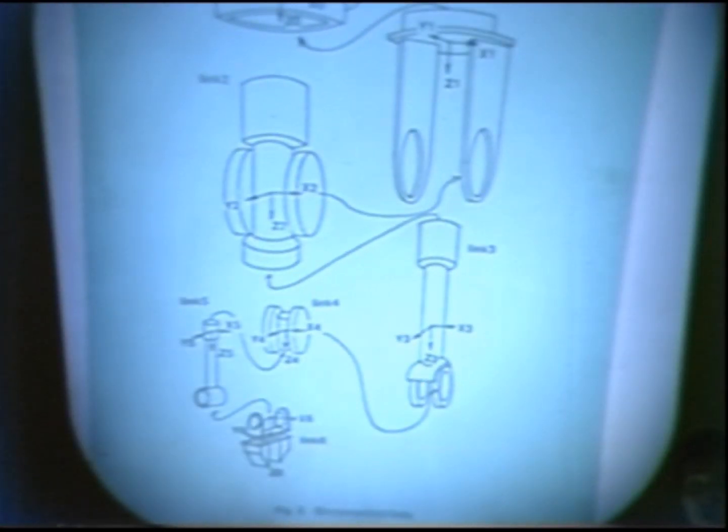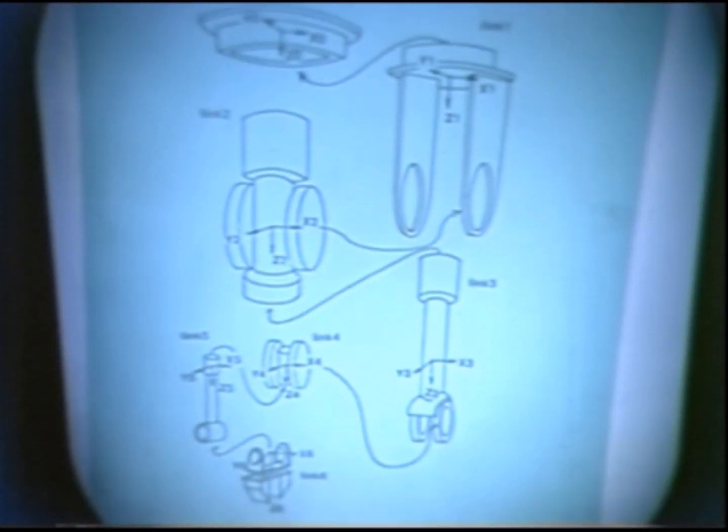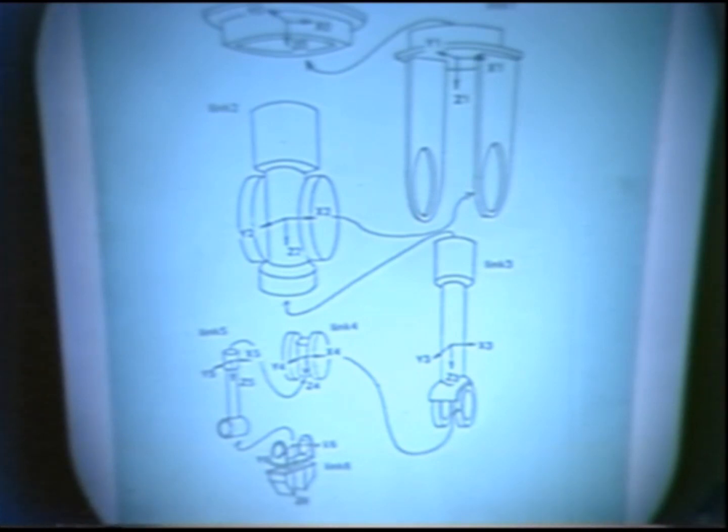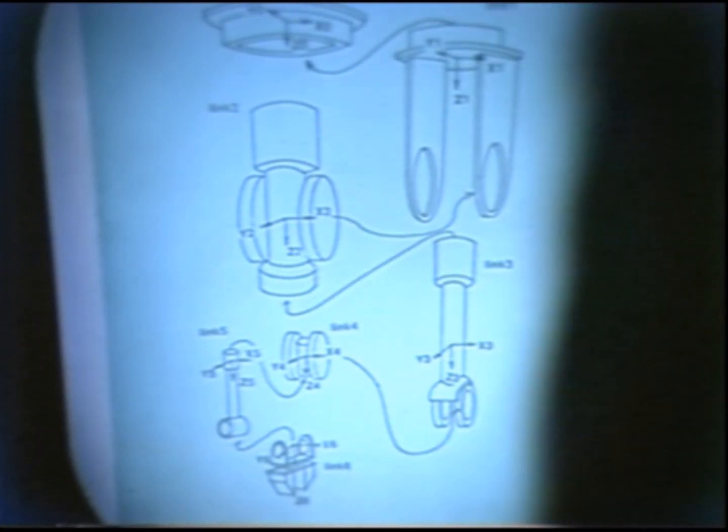So we computed the moment of inertia and the mass of the joint respectively. This figure shows you these disconnected links. One of the advantages of direct drive joint is that we can get a very precise model of the mechanical arm because the arm does not have uncertain factors. So we compute the moment of inertia and the mass of each link as listed in this figure.